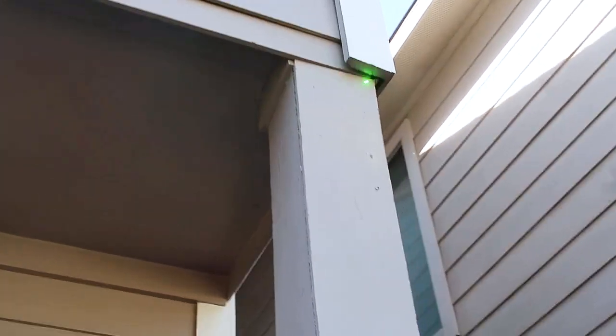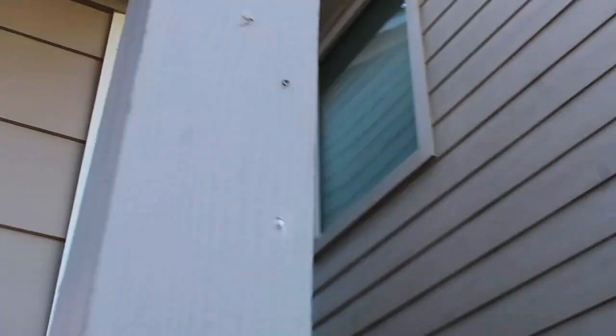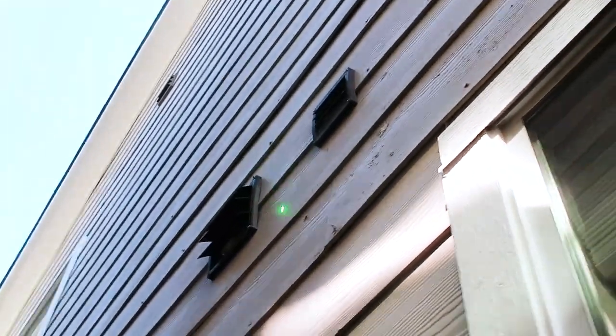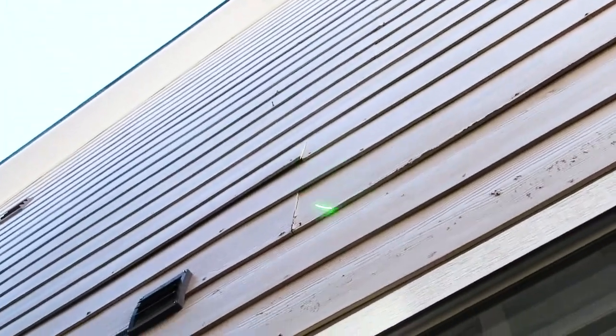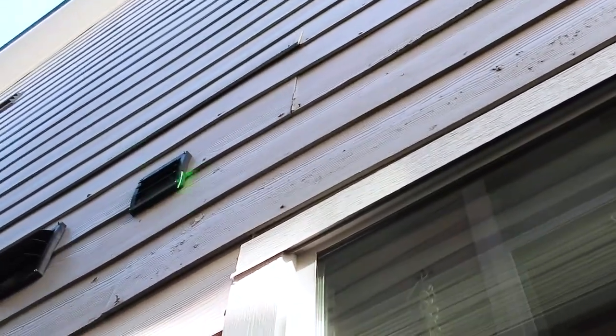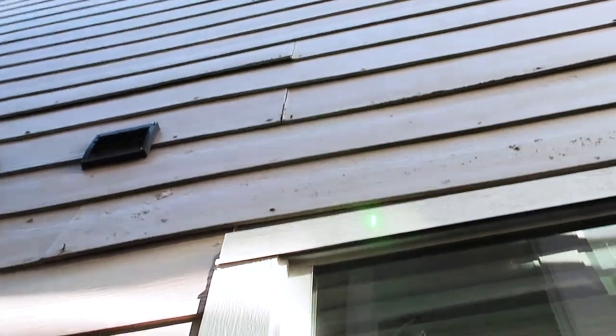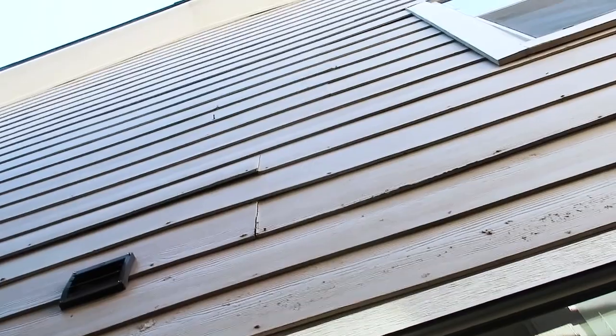Same thing over here — you need overhead flashing where the transition ends. You can see where we have some water damage of the board warping out over time. This could also be a little bit of settlement of how the house is resting in this area, pushing the board out a little bit. Coming around the corner, on the ends you can see these are not properly set in — they're not flashed and not caulked at all. This board is pulled out right here. These are mechanical exhausts — this is the range hood exhaust and this is the mechanical exhaust. You can see where the board is pushed out, and we think we're getting water penetration because right in this spot inside the home there is a water stain. We didn't get any active moisture on the infrared camera, but there's a lot of damaged siding here. The water stain runs right in line with this board that's pulled out, so we're going to recommend exterior siding repair.